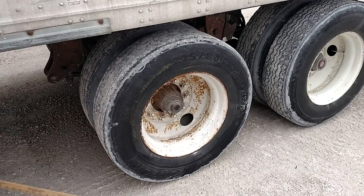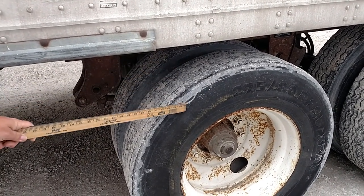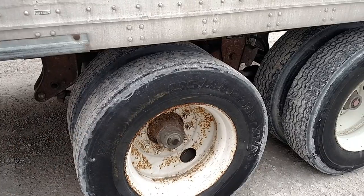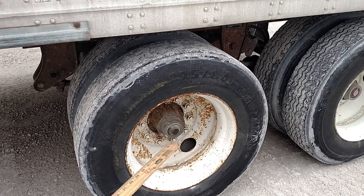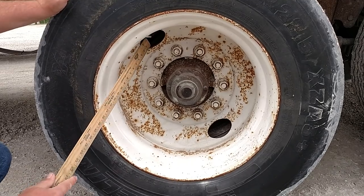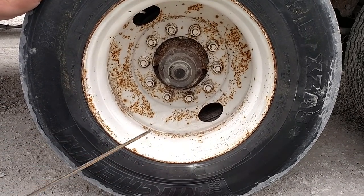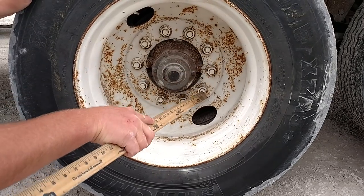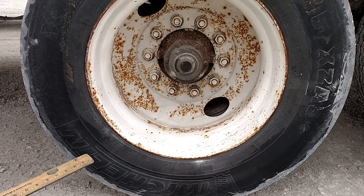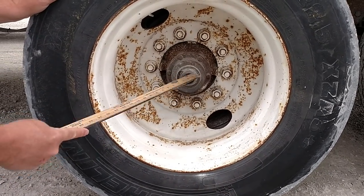Wheel assembly. The inner space here is free of debris, and tires are evenly spaced. All three sides of both tires have no abrasions, bulges, or cuts. The tread is worn evenly — I have two thirty-seconds of tread depth — and the tire is filled to the proper level, factory setting, whatever it says on the tire. I would check that with the tire gauge at the valve stem, which should not be bent, cracked, broken, or leaking air, and should have a cap — and that one does not. Both rims should be mounted securely, not cracked or broken, no unauthorized holes or welds. Lug nuts are all secure and tight, none are missing, and there's no sign of a loose lug nut like rust streaks or shiny threads from a cross-threaded nut. Outer hub seal: properly mounted, not cracked or broken, no missing nuts or bolts, not leaking, and filled to the proper level.